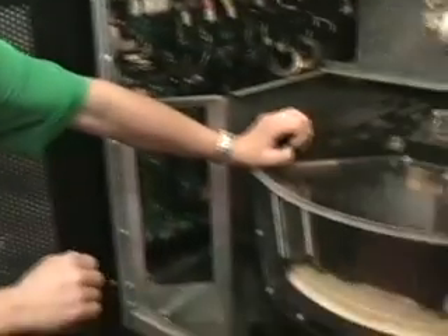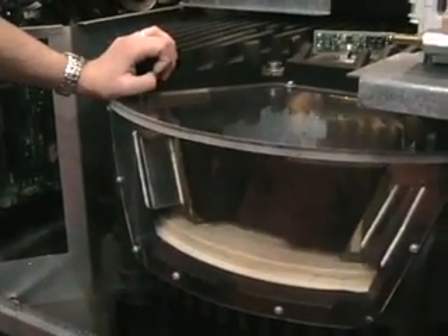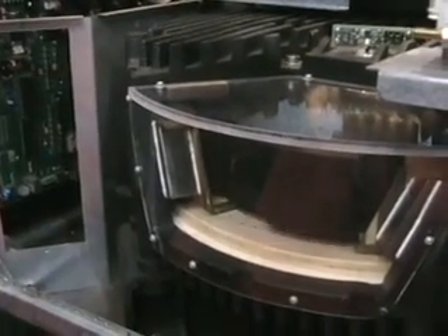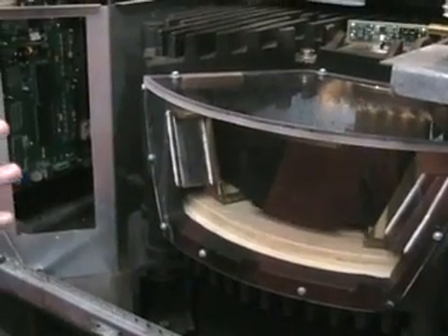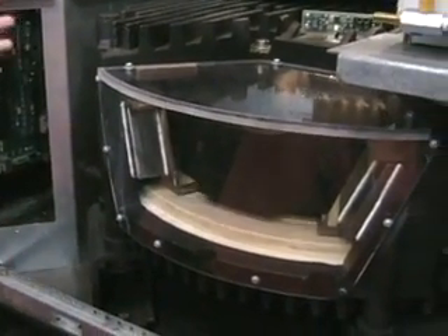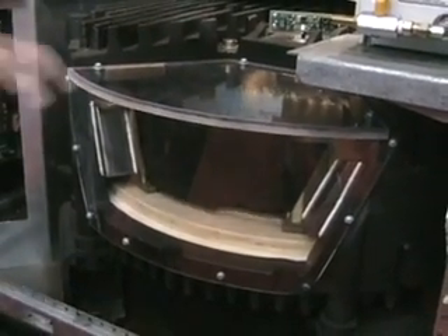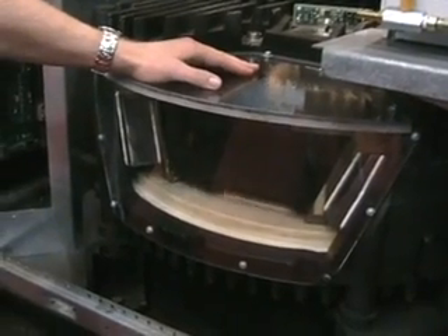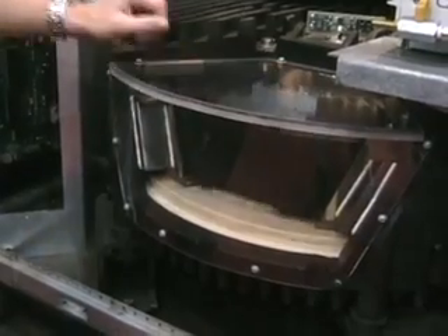And what kind of fascinating thing do you have your hand on? What we're standing in front of here is what we call the UPS flywheel system. So it's basically your legacy type of UPS system, three-phase. It's a 300 kVA UPS. Instead of a bunch of chemical batteries sitting on racks around it, we basically have this flywheel here, which produces 250 kilowatts of energy.